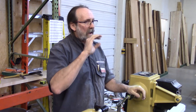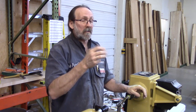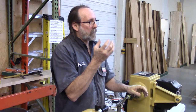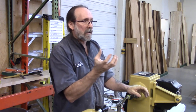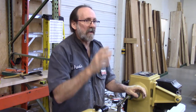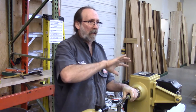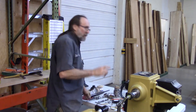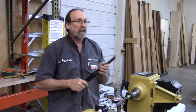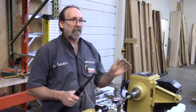So if you're going to do a CA finish on a ring, you're basically penetrating the wood with the CA. You do two or three coats of thin CA and you're done. Now that the wood in the blank has absorbed all that CA, you're polishing that CA that's in the wood. So now you're going to take that CA off of the metal. So I even actually take my skew and my wedding ring, and I rounded it. So I cut into the stainless on each side and rounded that some to get the CA off of it.